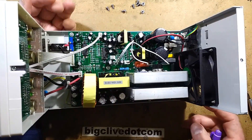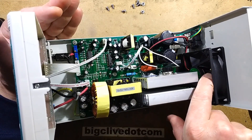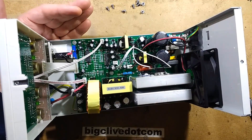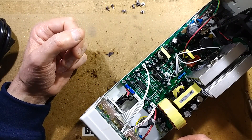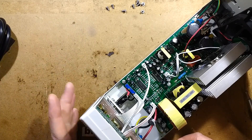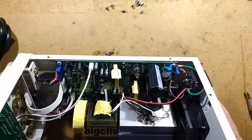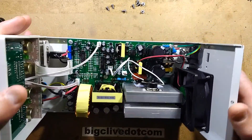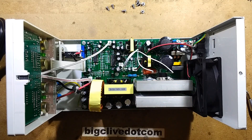So the inside of the power supply is okay - it doesn't get too hot. It's got another quirk: if you set it at a low level the fan just keeps jittering backwards and forwards like it's being pulsed. I haven't given it a full isolation test - it would have been interesting to tear it completely apart, but I can't do that right now due to time constraints. Maybe in the future. But so far it looks like it's built like a really good quality switch mode power supply.